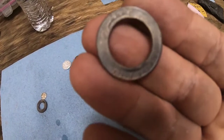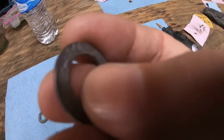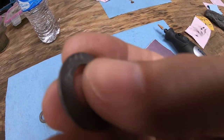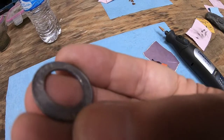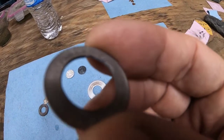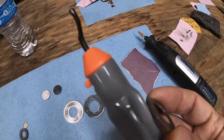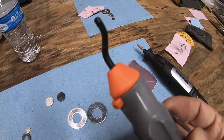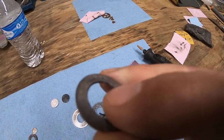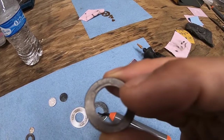One of the first things that I do is make sure that the inside here where I punch the hole, the edges are rounded and smooth before I start any type of folding or stretching. And I don't mean just hitting it with sandpaper or a file. What I do is I start off first with this deburring tool. Pick these up at Home Depot, online, or wherever. Go around the edges to get the sharp edge off, to get it beveled to start with.